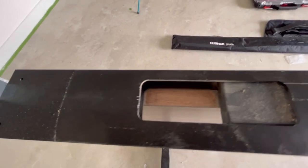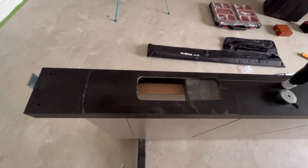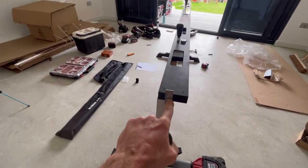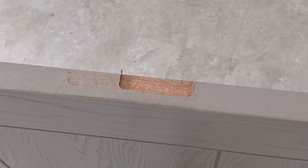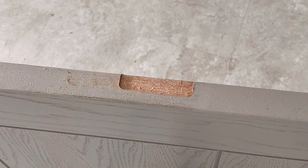I'll go around that again because I'm doing it one-handed. There's your hinge hole — you'll need a corner chisel to take out the round bits. I'll repeat that down the bottom and then get the hinges fixed. One thing I need to point out is that you must plunge your blade that extra thickness to account for any paint layer. I thought the hinge wasn't seating correctly, but all I did was plunge it to the right thickness and it works fine.